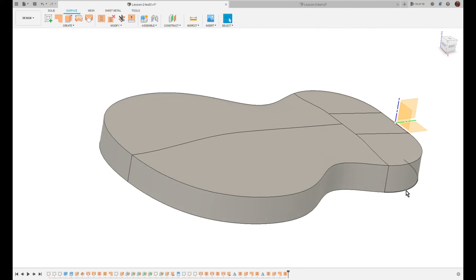Next time I will show you how I deal with the cutaway. It's really complicated because if you cut the cutaway part on the Les Paul, you know that the binding is really high in this place. If you are making a solid body, it's not a big deal, but when you make a hollow body like me, it's sometimes a big deal, and I have to make some bevel over there. So again, I didn't figure out how to make the cutaway part, you know, with the horn being arched also. So for now I have to make a bevel, like the arm bevel on the acoustic, and I find it really tedious. So I have to find a way to make a better horn, but it will be for another video.